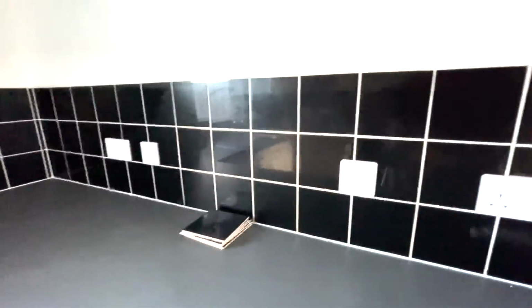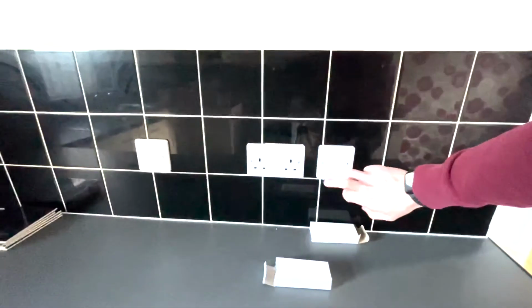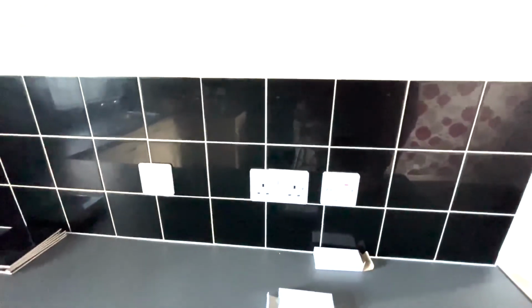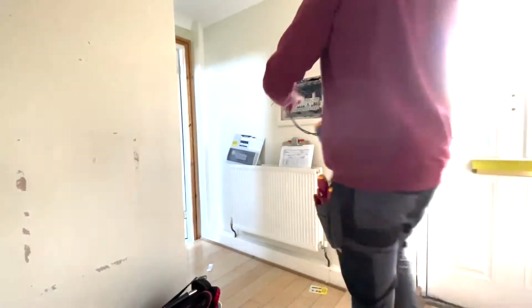No, it's got power off. What a fucking idiot. Yeah, one of these basically will be wired wrong, and the live for the ring will be in the load side. So basically, as long as these are turned on, you've got your full ring. Second someone turns these off, you lose your ring. Which one could it be though? Well, I reckon that one's going to be the hardest to get to. So switch that on. Now we'll have a look at this again.